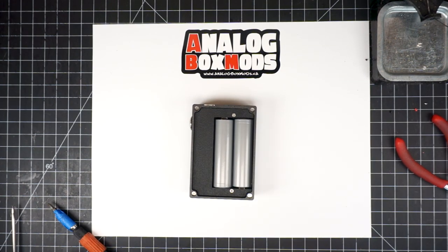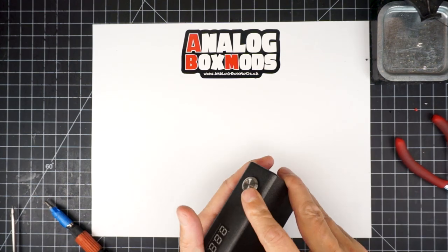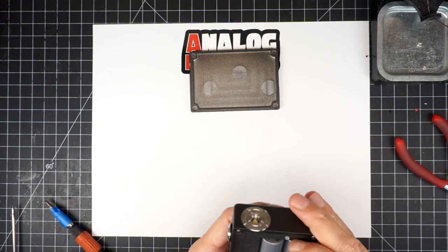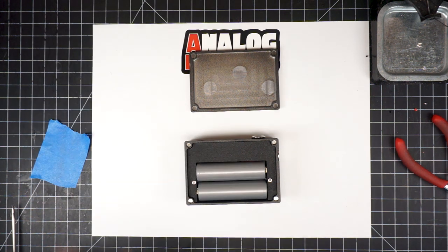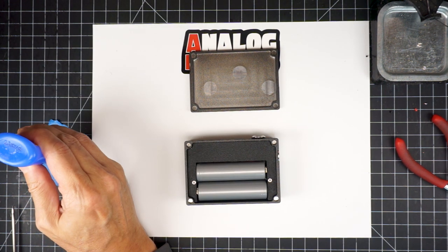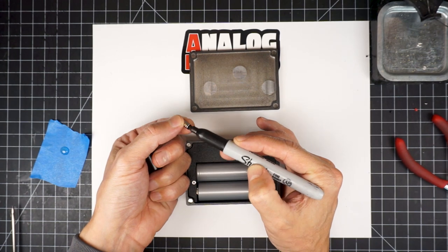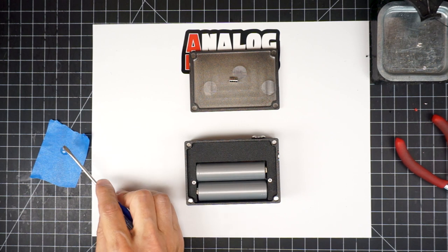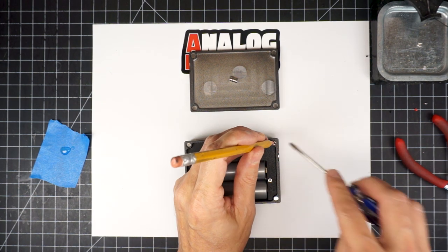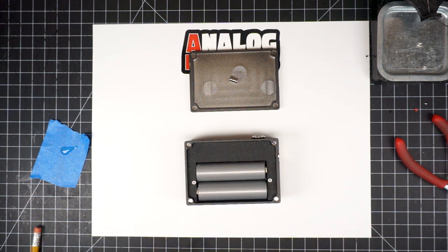That's looking pretty clean. And last, the magnets. You've probably heard me say this in the other videos, but I like repeating it just in case. Put all your magnets in a stack, mark the opposite ends, then you feed from the unmarked side of the stack. Make sure you don't mess up the polarity on these magnets. So always feeding from the unmarked side of the stack.